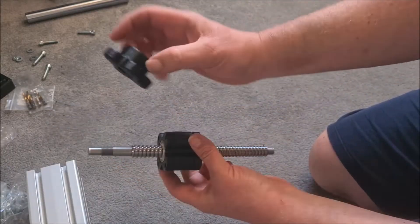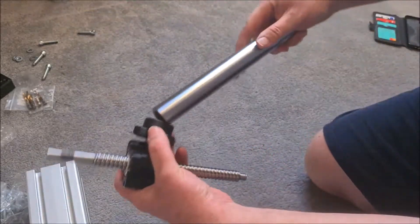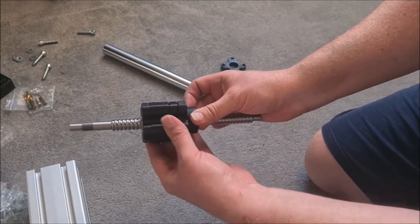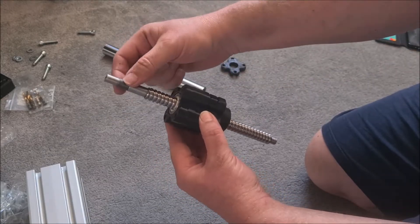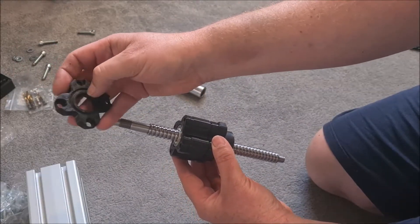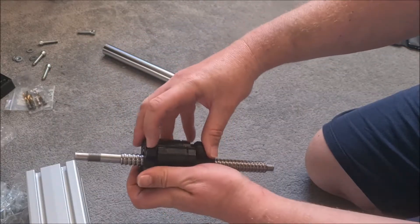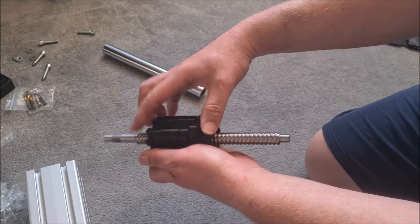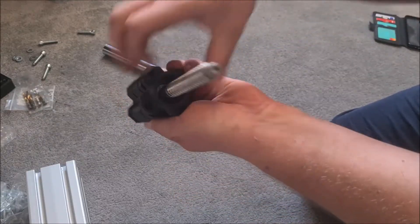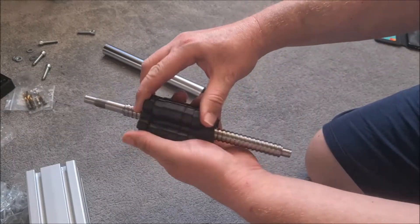This piece with the nose on accepts the shaft. It goes up the underside to the other side of the end that's got the thread on. Then this top plate, like the original SFX100 with the O-ring in it, goes on top. Then long M6 by 60mm bolts with M6 nylocks into the hexagonal recesses in the bottom hold it all together to make your slider assembly.